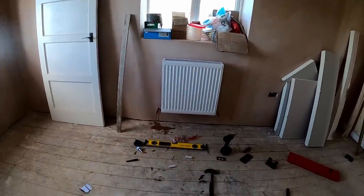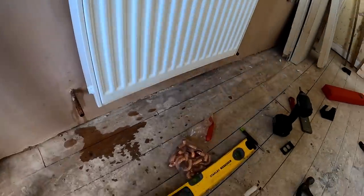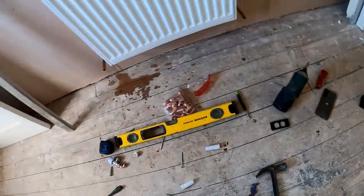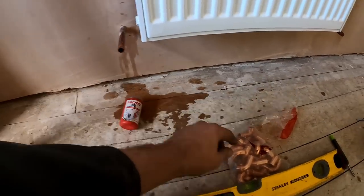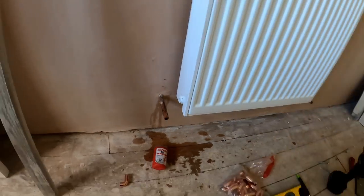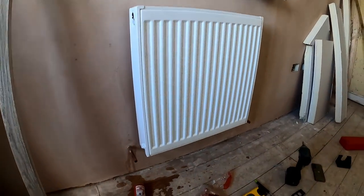Yeah, that looks fine. So I've got the valves in, the tails in. I still use Loctite 55. I know some people use that blue, whatever it is, rapid blue. I stick to Loctite 55, never had a problem. Why change something if it doesn't need changing? And then literally, it'll just be a case of cutting that off, soldering that on, job done. And I think I've got 4 more upstairs or 5 more. Not too sure, but they're all the same.